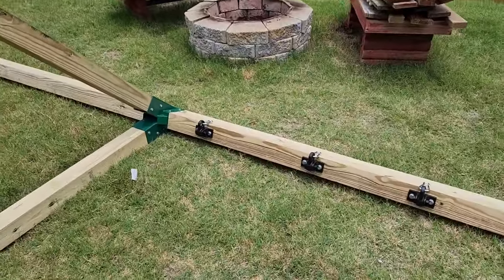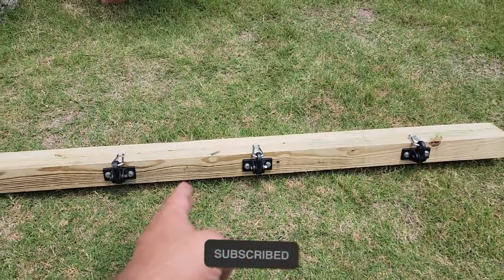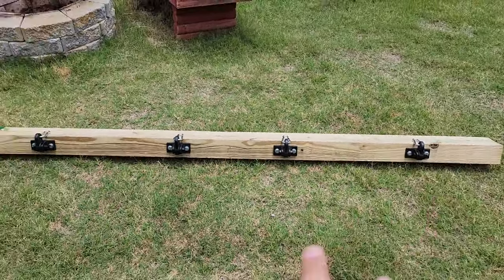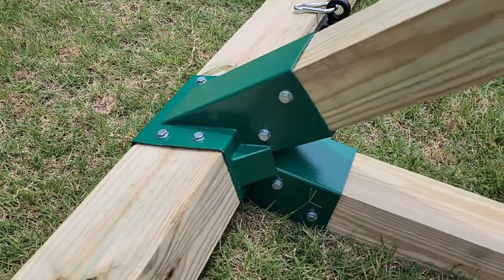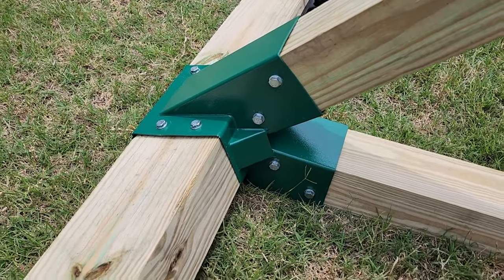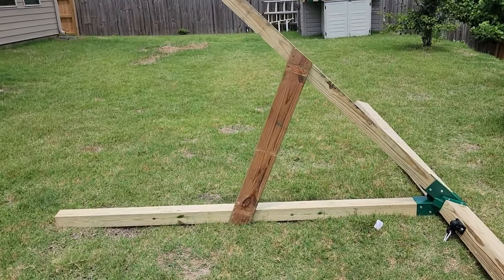As an advancement while some parts come in from Amazon, I ended up adding the hinges. The length here is about 88 inches long. I found the middle spot at 44 inches and eyeballed the placement from there. There are two hinges here and two hinges on the other end. I pre-drilled the holes before putting in the screws - you definitely want to do that so the wood doesn't crack. I also put a piece across the A-beam to make it a lot more sturdy to handle the weight.